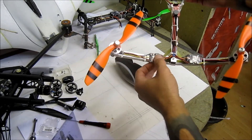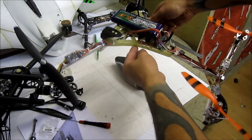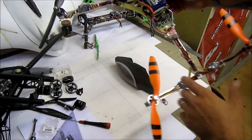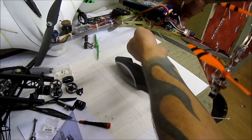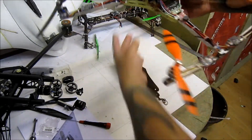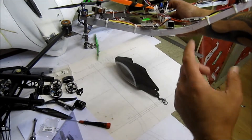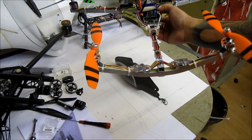The whole point was to make it like a tricopter, where one front motor's power is roughly equal to one of the rear ones. The center of gravity is like a tricopter's. The tilt angle is 30 degrees each instead of 45, because 45 degrees loses way too much thrust — that's another thing I learned from the previous V-tail.